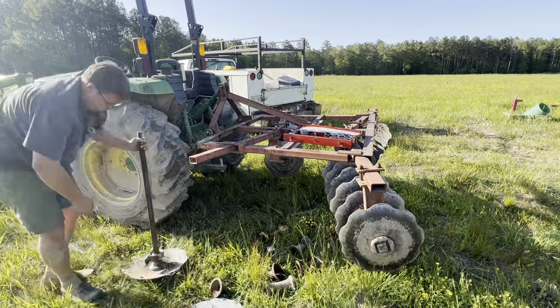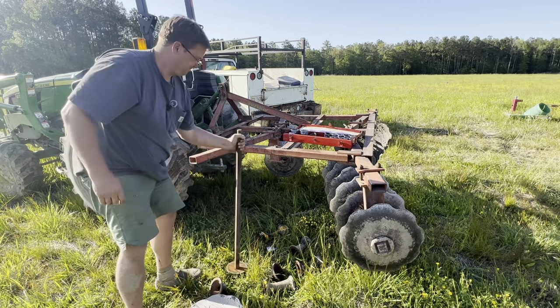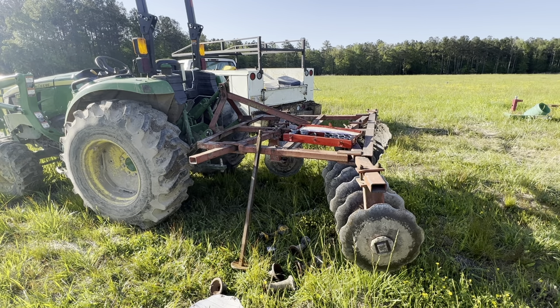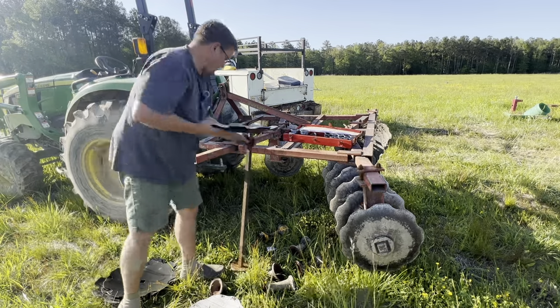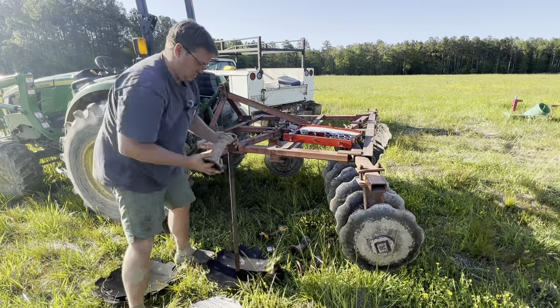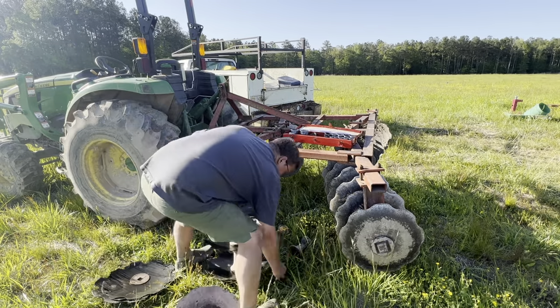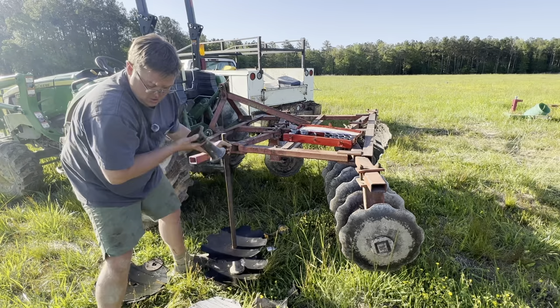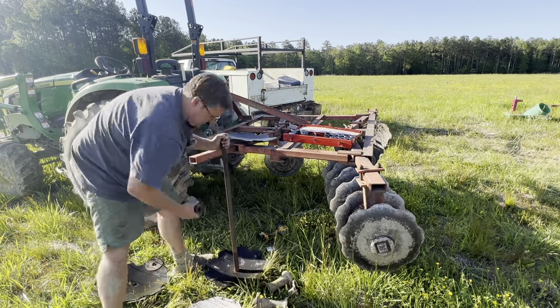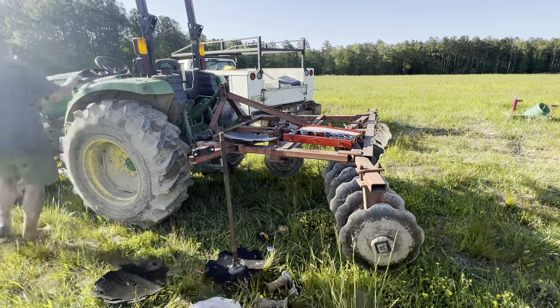I'm coming back and putting 18-inch blades on it. As worn as it is, the back blades measure about 17 and a half inches, so by putting 18-inch blades on the front, I think we'll be in good shape. I'm also replacing the bearings. At this point in the video, you can probably tell that I forgot to add the bearings to this axle with the discs on it — this front gang — and I've had to pull it apart now once.